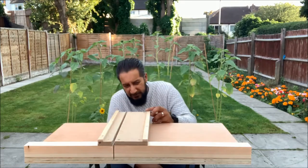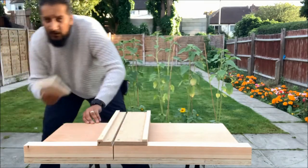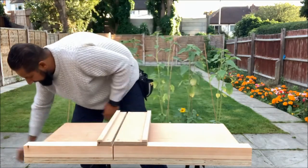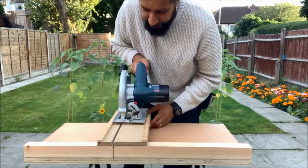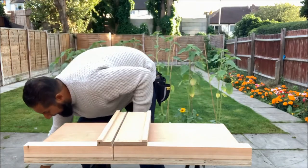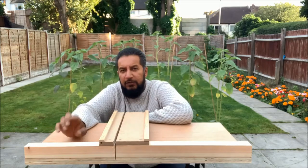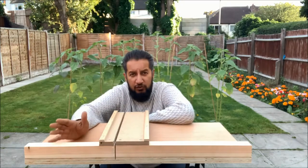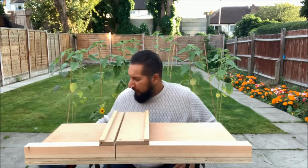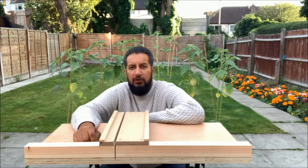The track is about 12mm wide by maybe five or six millimeters for the tops. I did want to use the same plywood as the base, but what happened was it made the depth too shallow — I could pass a piece of paper underneath it, and we didn't want that. So I had to change my design. I'd also like to make a few design tweaks from watching Glenn's video — nothing to do with the video itself, purely because he used a Ridgid circular saw whereas mine is a Bosch, and the switches, levers, and knobs are in different locations. Unfortunately that meant I came across quite a few hurdles.